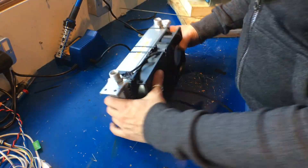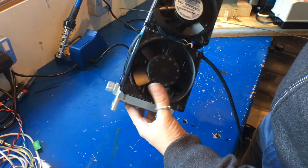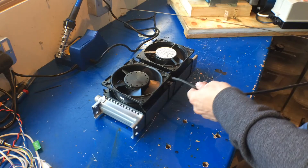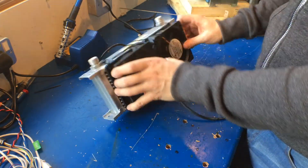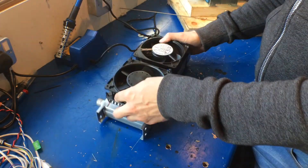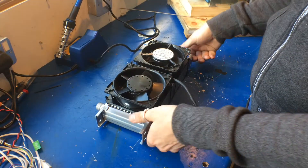That's that bit done. There's my very cavalier attachment of cable tying the fans onto the radiator. I've wired it up so I've got mains power coming in, the live terminal going to each fan, the neutral going through the temperature-controlled switch, and the earths connected on both sides. This end of the mains cable I'll have to wire into my direct online starter in a minute.